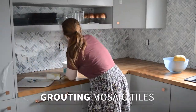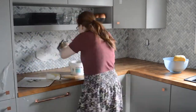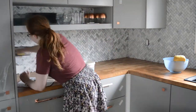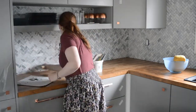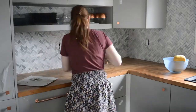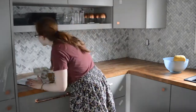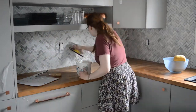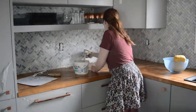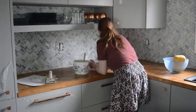Mixing grout is similar to mixing thinset and you can also buy pre-mixed grout. For our tiles, they suggested using an unsanded grout, and luckily I had one in a white color already. I also had a sanded grout in gray, which would have worked for our kitchen color scheme. Essentially, your grout color can make or break your project — if you don't have a perfect tiling job, choosing a contrasting grout can really show those imperfections. Choosing a grout color similar to your tiles will hide some imperfections, but it also depends on the style you want.